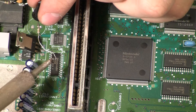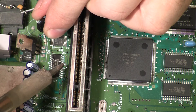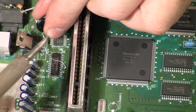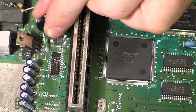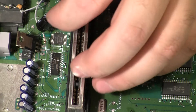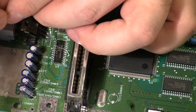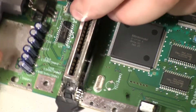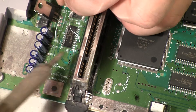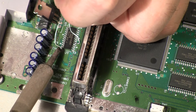I've put a hook on the end of the resistor lead and I'm just going to lay it on pin 17, then touch both of them with the soldering iron — try to keep it steady. Chroma is much easier since it's pin 12, right on the end. I actually put some flux on both of the pins of the IC.